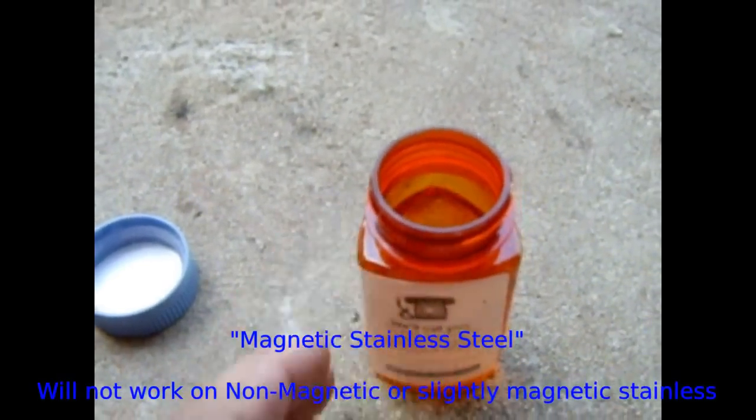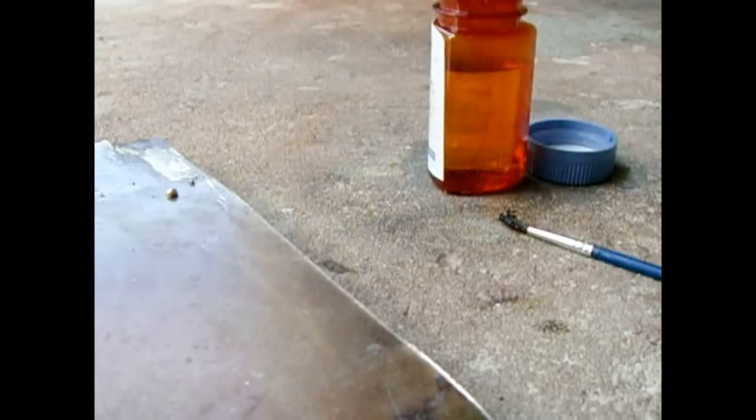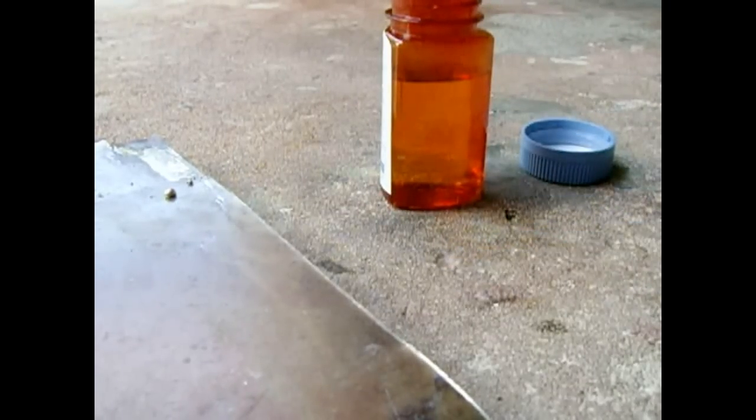The entire amount is now dissolved into this little bottle. When I was finished, I took a plastic spoon and scooped up the little bit of carbon sediment that was on top, then took a Q-tip and wiped away any little excess. Now we have a very good mix — it's clear — and that is ready to be used as a flux for soldering sheet metal and stainless steel, which I will demonstrate in a minute.